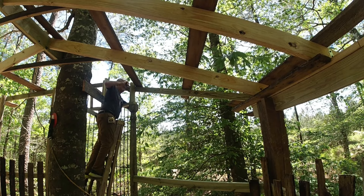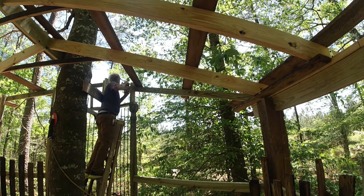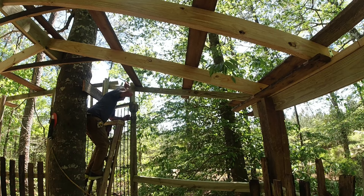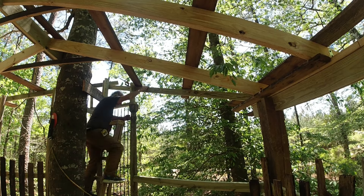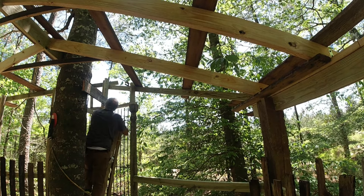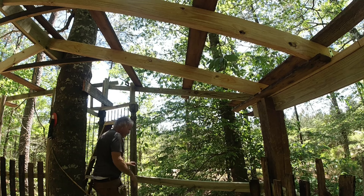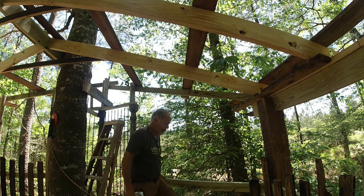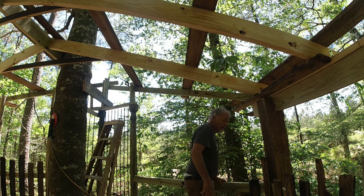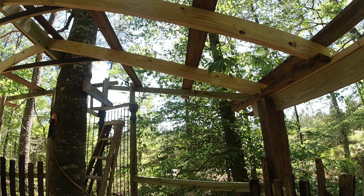On the other end, sticking out above the beam holding up the bottom of the rafters, I did something similar so I could get the rafter out there and set it in place, then relax and move my ladder into the right spot. I shoved the rafter up until it's pushing up on the overhanging five-quarter-by-sixes — the stripping for the sheet metal — and got a clamp on it. I think it's in the right spot, so I'm going to go down to the bottom and check to make sure the bottom is okay.